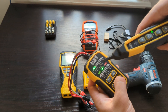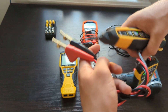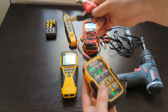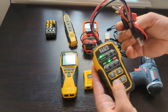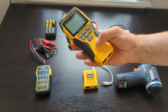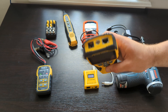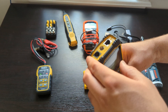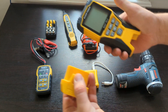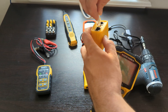Also, you can test the polarity — for example, trace which one is black and which one is red cable, if you have two lines. The next tester is this one. It can also do the toning function, and if a cable is crimped toward RJ45, coax, or phone cable, it's better to use this one. You can also test the lines with the other end.